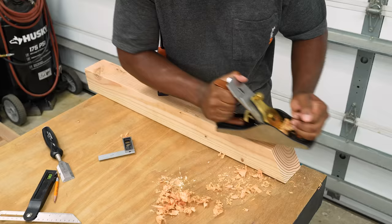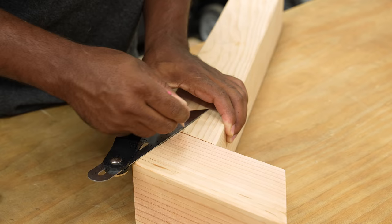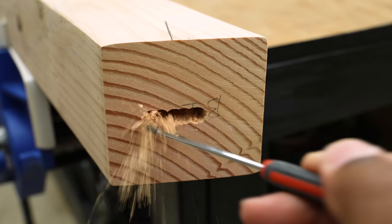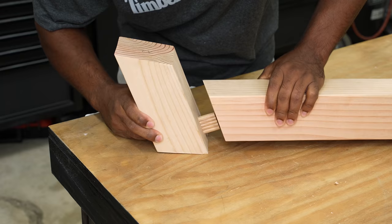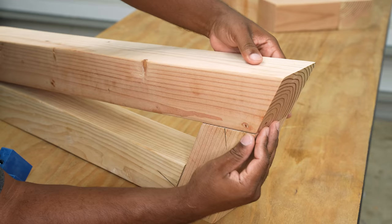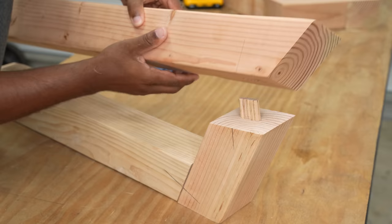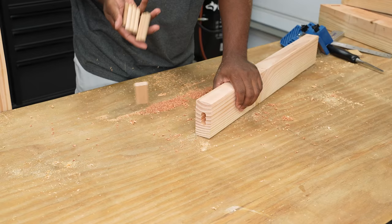Some connections went fairly easy and some didn't go as smooth. In those cases I used a hand plane to clean up the sections and make sure they fit together nicely. For the midsections I lined the parts up, drew a line across both, then lined up the jig and drilled the holes. If holes are off I would plug them and re-drill. With lumber from the box store often being twisted or inconsistent in thickness, I'll just use a hand plane to clean it up.